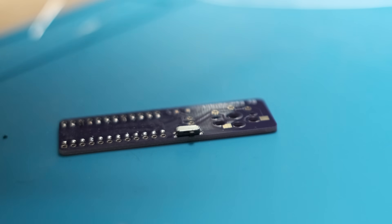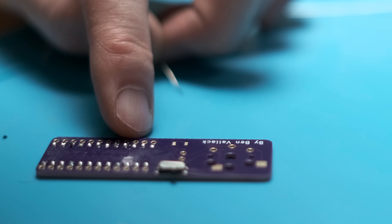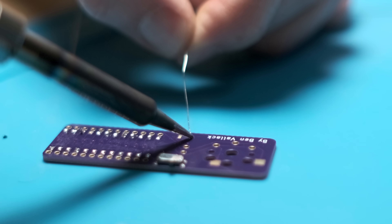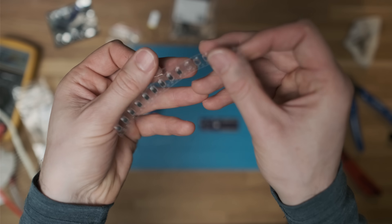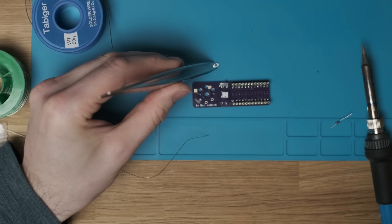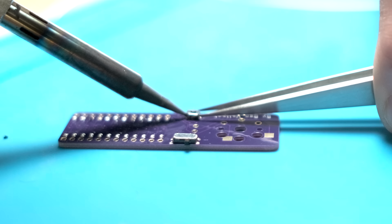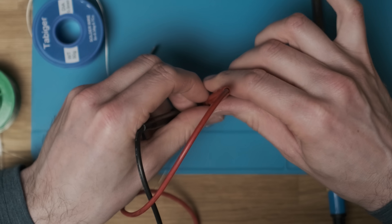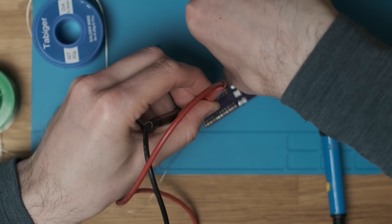These shots are a little bit in the wrong order — I'm doing the reset button now, but the sockets and battery connector aren't actually on this board at this point. We've got two tiny pads, so we add a bit of heat for a very short amount of time and pop some solder on there. You don't want the iron too hot because you can burn those pads off the board quite easily. We get the tiny little reset button, place it over the top of the pads, add heat to the foot of the switch and push it down onto the blob of solder so it sinks in. We can then check it works by finding the reset and ground pins on the socket, pushing the button, and hearing the beep from the multimeter.